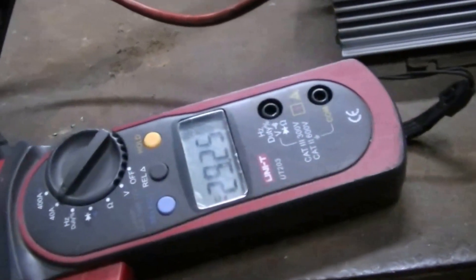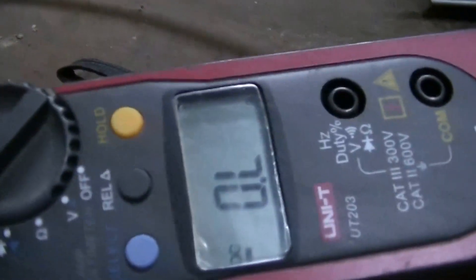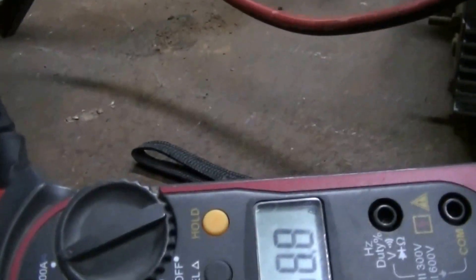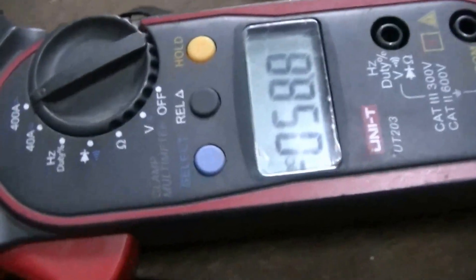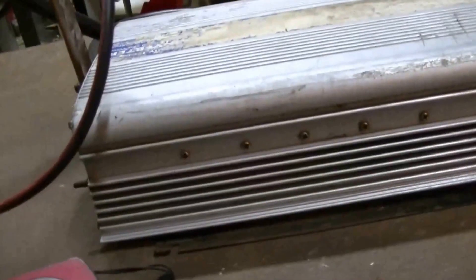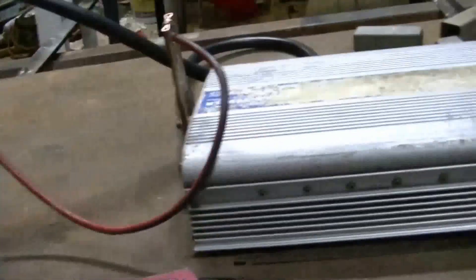So basically we'll start with 300 watts — okay, 600 watts and my meter is freaking out already. Basically we're pulling 50-something amps at 600 watts. Okay we've got something beeping — the inverter doesn't like it. Might get the kettle, we'll try the kettle. Geez, the inverter doesn't even work with too small a wire.